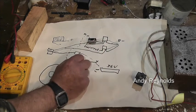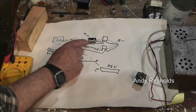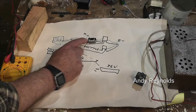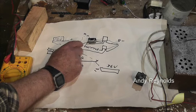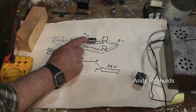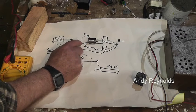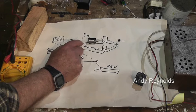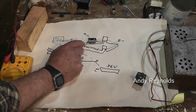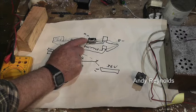I'm using 33 microfarad at 100 volts, which is fine — we're only on 36 volts. It could be, for instance, a 60-volt capacitor at 50 microfarads or 20 microfarads. You just make sure it suppresses the spark for the current that you're actually switching.